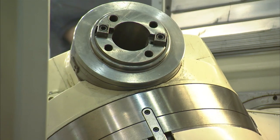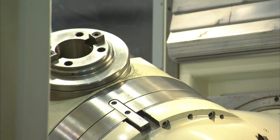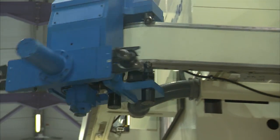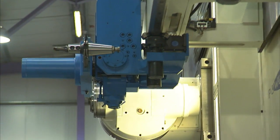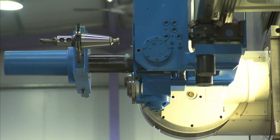If he wants to do light milling we can hold it in live servo. And from the milling perspective, you've got a table, a floor — a travelling column machine with the floor table where you can locate the parts and then machine 5-axis, 3-axis or 4-axis on that side of the machine. We can machine off the fixed work plate using the 1 degree head which is capable of positioning in the A axis and the C axis.